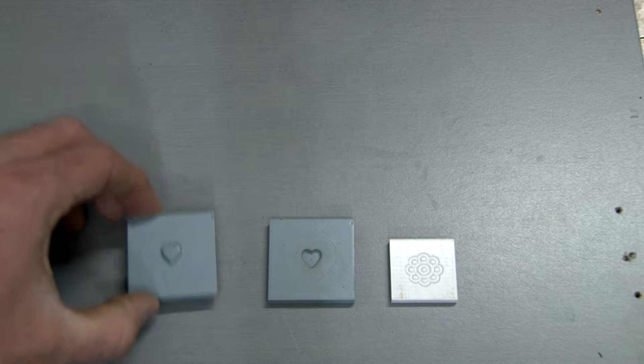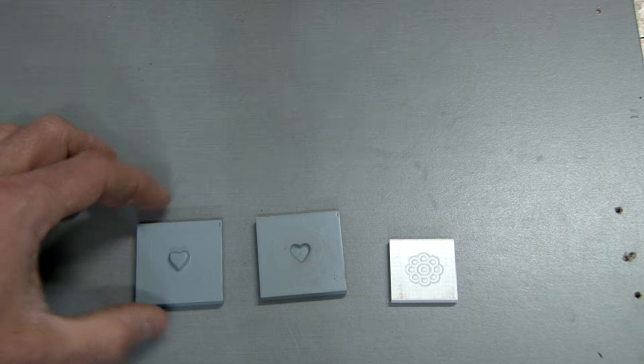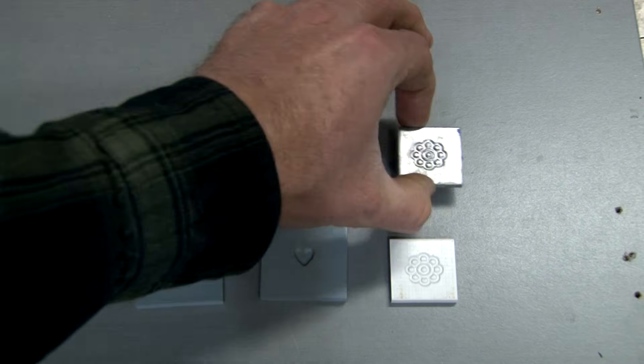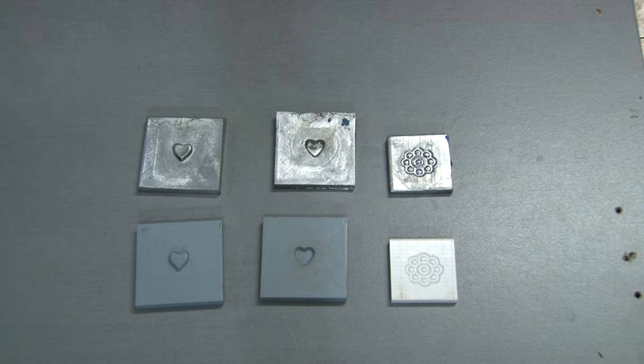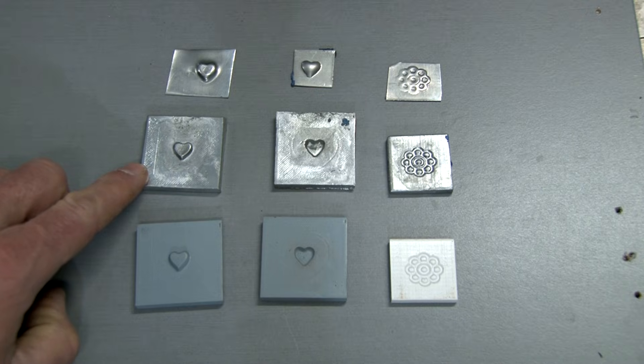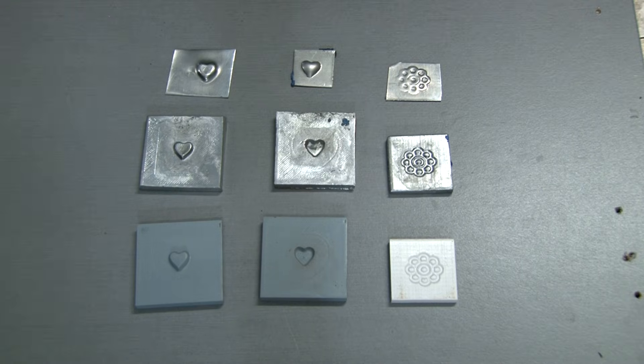Here's the plan of attack. I went ahead and 3D printed these and gave them a light coat of paint so the sand doesn't stick to it. After that, we're going to cast them and make aluminum dies out of them so they can be put in my 20-ton shop press to see what type of formations in the metal we can get. Doing something like this is cheap and quick, and it costs nowhere near as much as having something machined out of a block of tool steel, which would cost quite a bit of money.